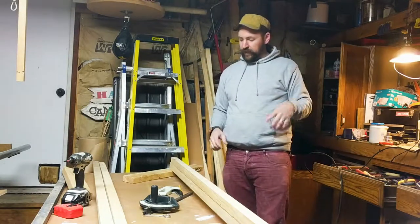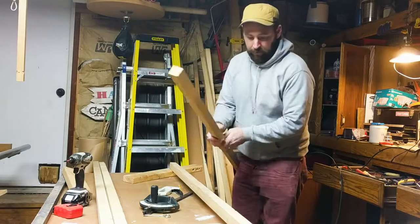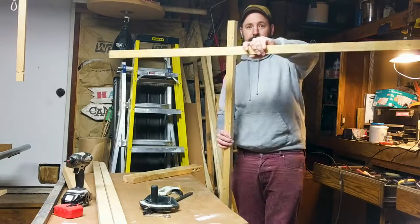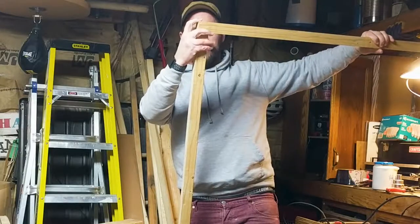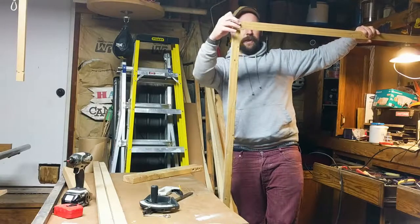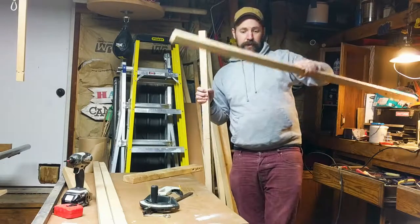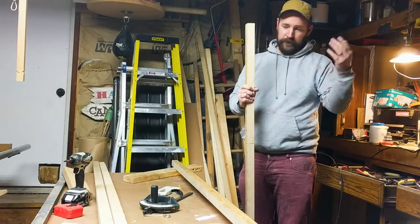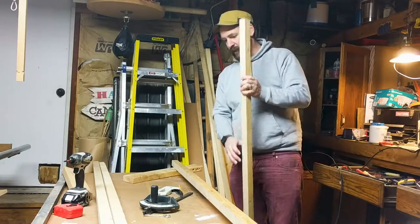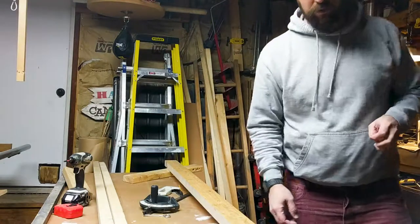The way that I'm gonna butt these up is, I'm gonna build the screen with the sides coming in to the bottoms, and then joint like that, and then I'm just gonna run a screw down through. So the top and bottom pieces will be full length, and end pieces will be the height minus the thickness of the top and bottom. Go from there.